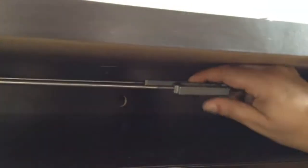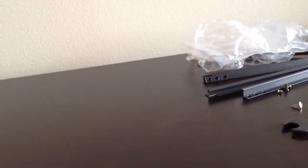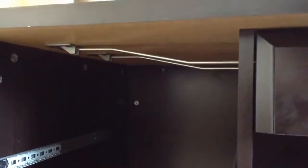One thing you'll see in the instruction book is this cross-bracing. I've had difficulty deciding whether or not it's even necessary — a lot of desks don't have it. I decided to go ahead and put it in for purposes of the video. It's a kind of complex metal rail setup that is there to prevent the desk from eventually sagging from pressure. A lot of people leave these out. It's not something I'd necessarily recommend, as long as you can have a little floor bracing there. The thing that irritates me about it is it can kind of block off part of your keyboard drawer if you use one of those taller Microsoft ergonomic keyboards. But as you tighten this down, it will help actually bow this upward so you can compensate for any additional weight.